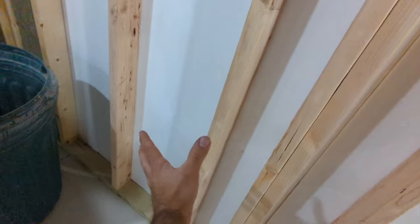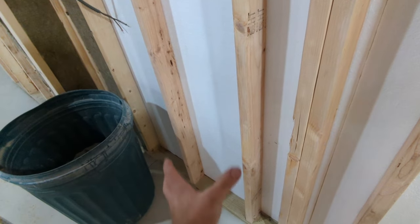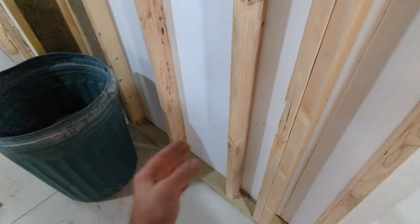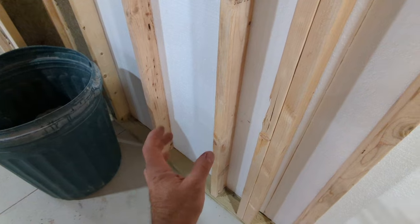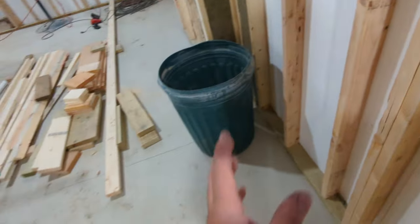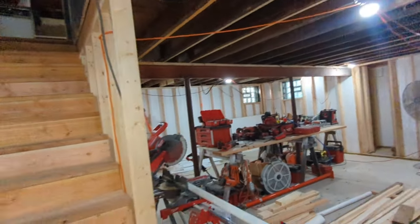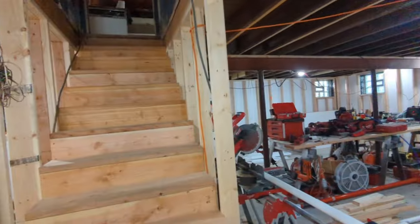hot air used to come out, which is like a nice cast iron radiator that sits on the floor, short, tall, thin thing. And just go right into the wall with rigid piping, adapt to PEX, go right down the old duct with the PEX and coming down here and tie it right in, and then those radiators on the second floor will supply heat to your house.